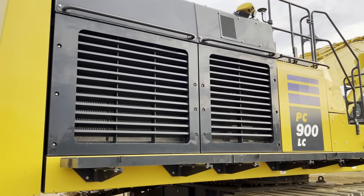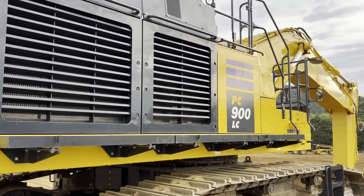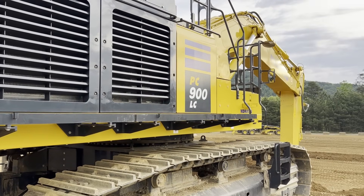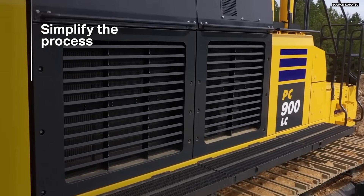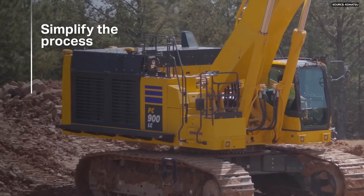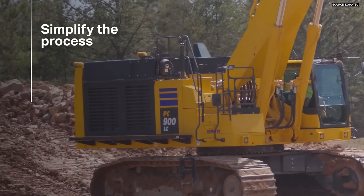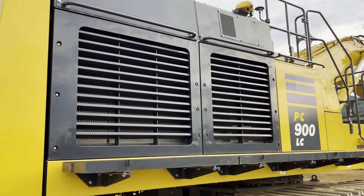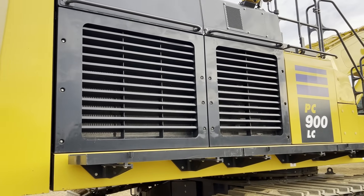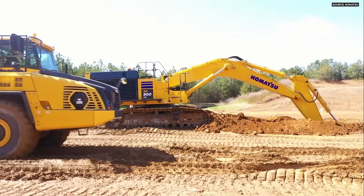On the right side of the machine, one of the big improvements — because of our increase in performance, we don't want to sacrifice reliability or efficiency — so we have a new single plane cooler design. Those six bolts in the middle of the two panels can be removed so you can open up these panels and get great access to service and clean out the coolers.